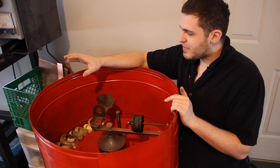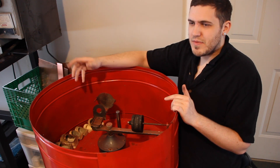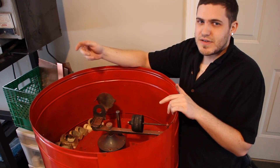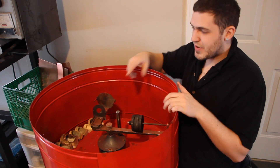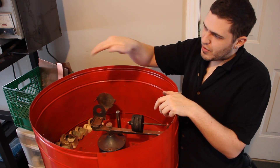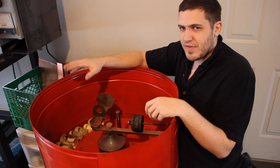There's also a myth I'll address briefly: the myth is that a centrifuge cast will create a denser casting. I'm not entirely sure what that means, because metal can be work hardened, but it's not like a gas where it's condensed — it doesn't work that way. The bottom line is that this does not produce a better casting than vacuum cast. In fact, there's actually the possibility with centrifuge casting that because the arm is in motion, if you don't develop your sprues in just such a way that the metal goes from the crucible into place instantly, it can create turbulence. The metal hits a sharp corner and starts to roll on itself, it's already starting to harden, it clogs the tube or doesn't quite get to the end of the cast, and you get porosity or incomplete casts.